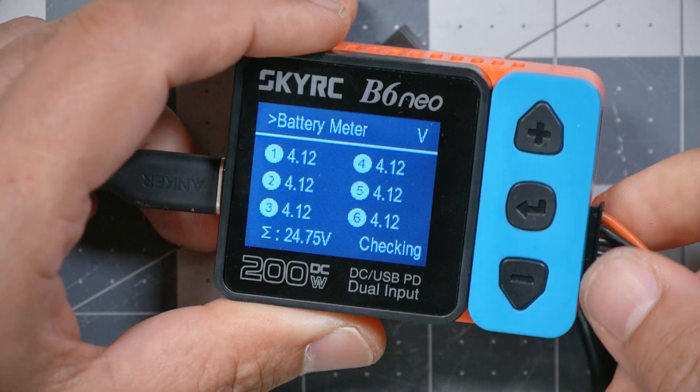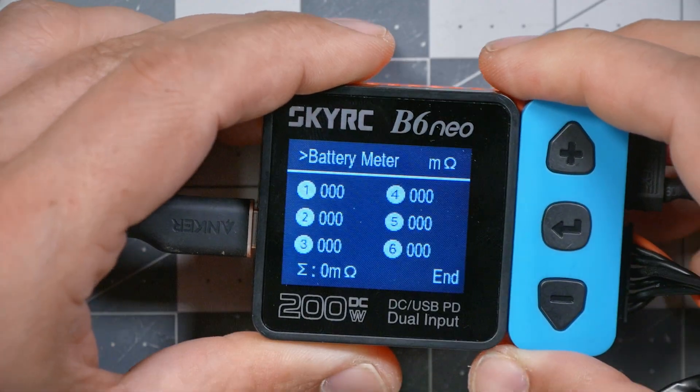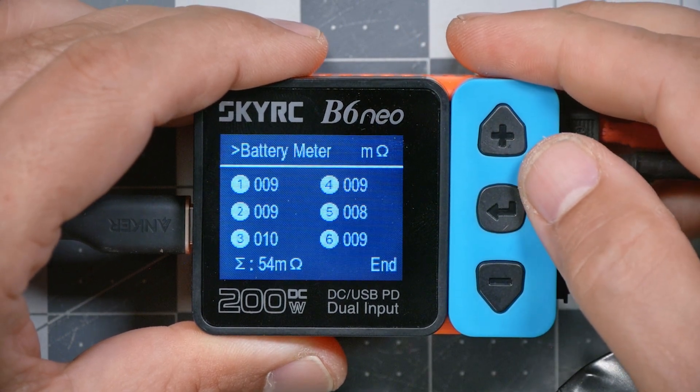There's a battery meter function. It's a bit cumbersome as a quick battery checker since you have to hold down the menu and scroll through, but it's nice that it's there. And pressing the up arrow shows milliohms — it'll do internal resistance testing! That's really nice, because a lot of other chargers only test internal resistance during the charge cycle. So if you just got a battery and want to measure the IR, you'd normally have to start a charge cycle. Being able to just plug a battery in and immediately measure internal resistance is pretty convenient.